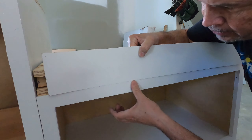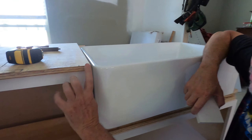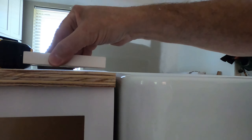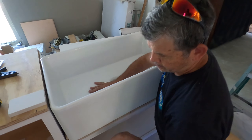This will be at the bottom of the sink and it'll look perfect — we'll even do that on the sides. Let's throw the sink on here and check it one more time. There's our sink — imagine this is the sub-top on a cabinet adjacent to the sink. There's our stone counter, it's going to project out over the edge of the sink, and the countertop installers will put a bead of silicone right here so when they set it down, that'll all be sealed.